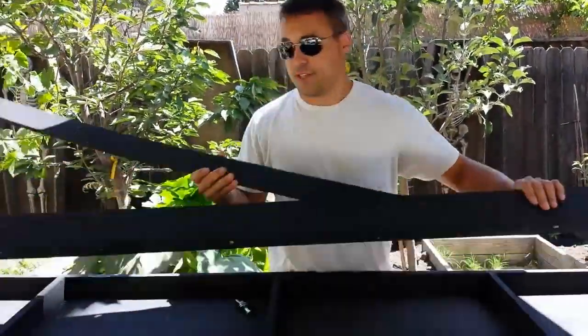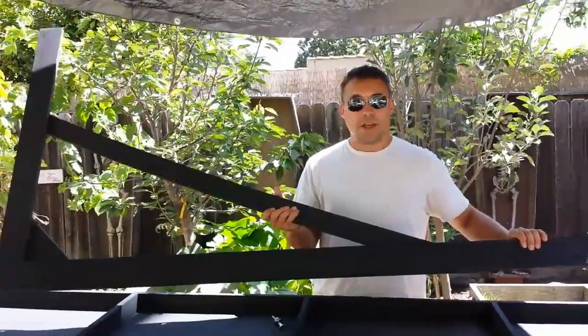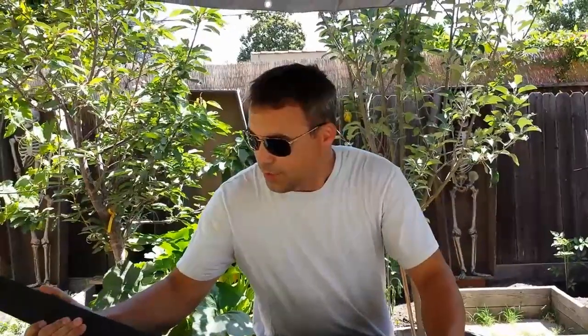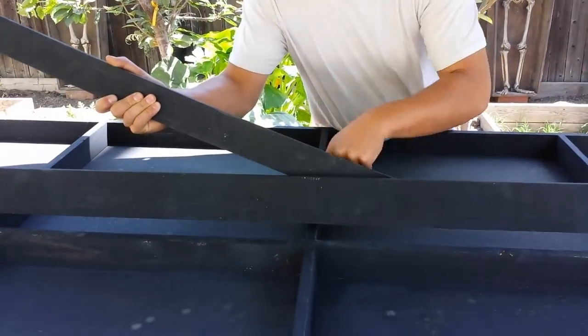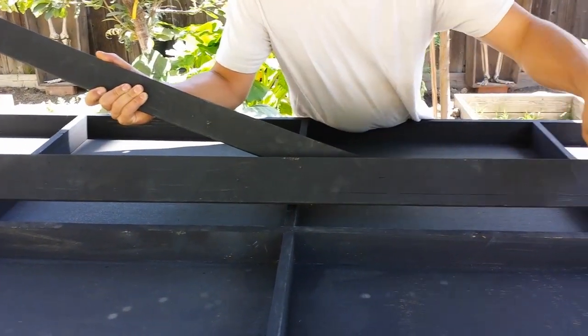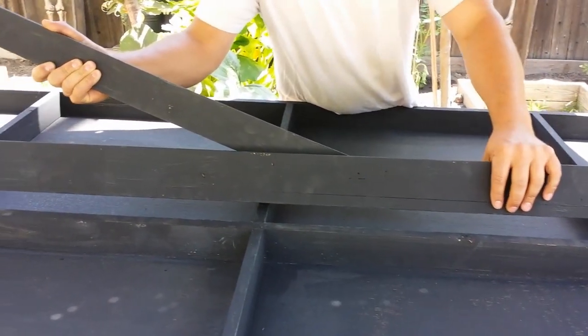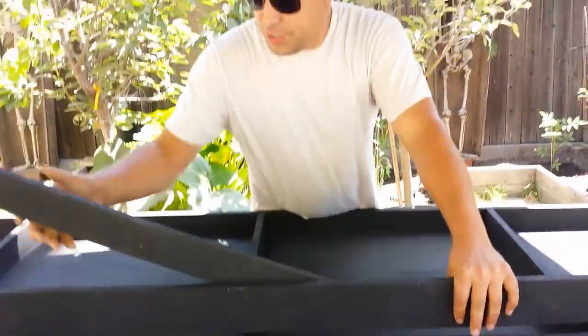Alright, so now that you have the walls all constructed, the next thing that we want to focus on is how you're going to stand them up and what's going to support them in the upright position. To do this, we usually make these jacks here. And typically what we do is once we stand the wall up, we set these jacks anywhere on the flat and just take like a drywall screw in through the jack into one of these 2-foot center 1x3s going all the way up, and you can put a screw or 2 screws in each one. That's normally what we do.